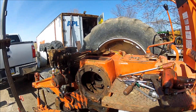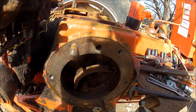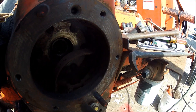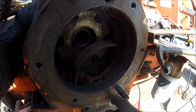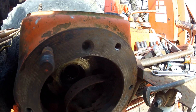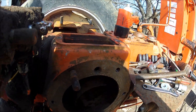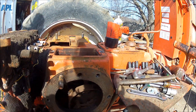Working on the brakes at 185 hours — God is shining his favor on me today. Thank you Jesus! This bottom anchor pin is actually moving, see it coming out. It was recessed back in this housing, which they typically are. I put a bunch of washers on a bolt, ran that bolt in and tightened it up to see if I could get that pin to start moving, and doggone if it didn't start moving.